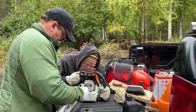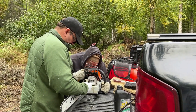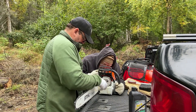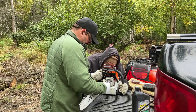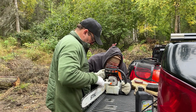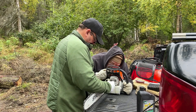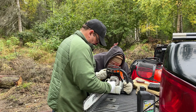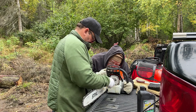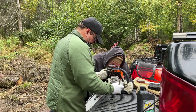This poor thing has ate some metal over the years — well, over the months. But gotta keep it going. I'm trying to do my best to maintain the 10 degrees on the tooth, and at the same time I'm also getting down the what they call the rake or the depth gauge, since I haven't touched those in a while.